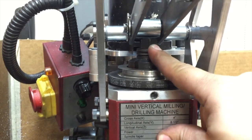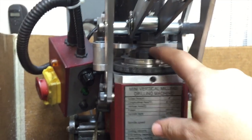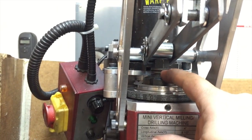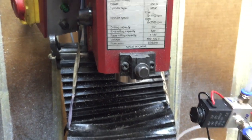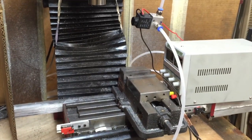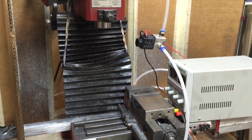The air cylinder pushes down on this bar — let's get a little closer — this bar has a little cam that pushes down on the drawbar. These are Belleville washers, trying six of them for now, and they act as a spring. Right now it's not holding anything, and they clamp tight when the air cylinder activates. It pushes down on the Belleville washers and it should drop the tool holder off the bottom. I don't have a dedicated switch right now; I'll use the main power switch of the power supply.